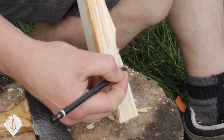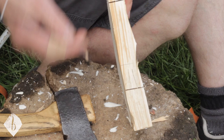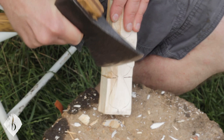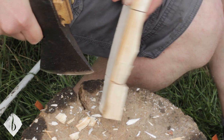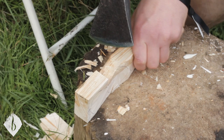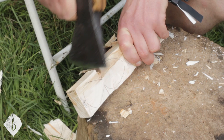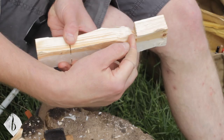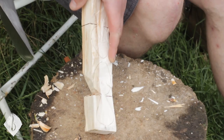So I'm going to work down these seams in thirds to get that flat surface - eventually back to a flat surface like this all the way along. There's your two thirds and your final one. It just comes out easier if you do that. You can use the flat of the material on the block and just alter your position a little bit, just to flick the corner of your axe into that little movement. Don't forget, you've always got your knife anyway to finish off - I'm just removing the bulk. I'm going to extend that taper a bit anyway, just taking more off at the back.